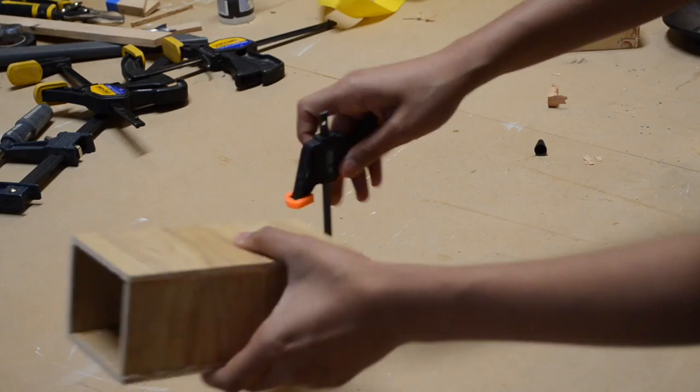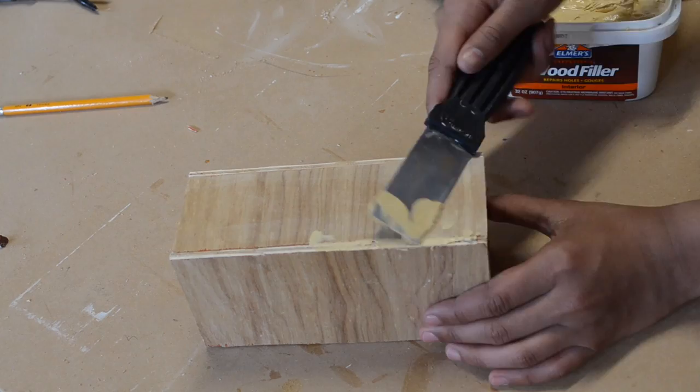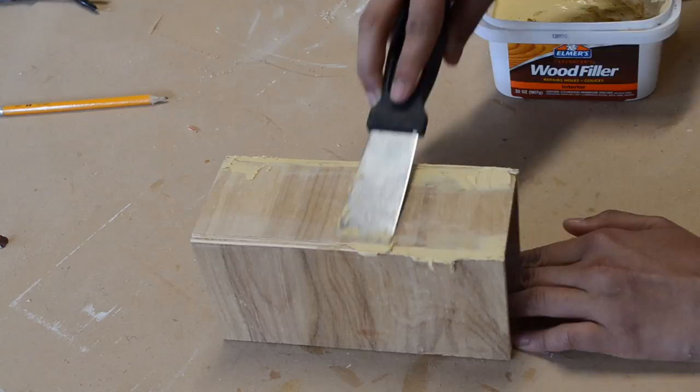Once the glue has dried, you can remove the clamps and apply some wood filler anywhere necessary. My wood filler is from Elmer's and I'll leave a link to it down in the description box. Just make sure that your wood filler is either stainable or color matched to the stain that we'll be applying.